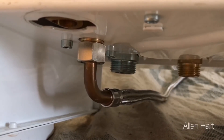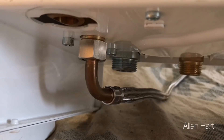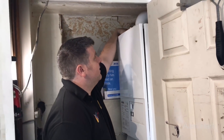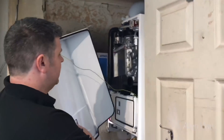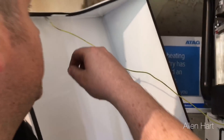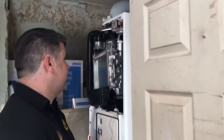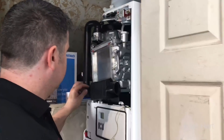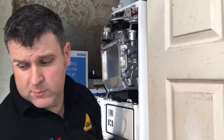If you have any problems with sludge blocking this pipe, you can easily disconnect it, take it off, and clean it out. To remove the case, unclip the top and the other side and the whole case will come forward. You'll notice on the case that they actually earth the case, because it has a physical seal on and obviously it doesn't earth itself naturally through any screws. The next thing you need to do is remove the silencer on the air intake — it's on some velcro and will physically lift up and off.